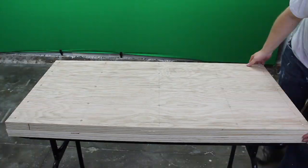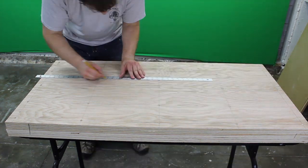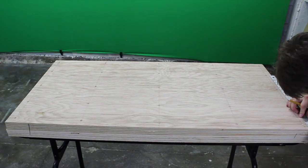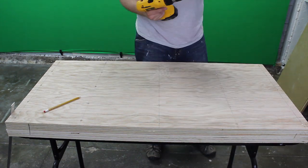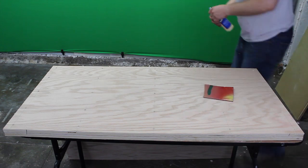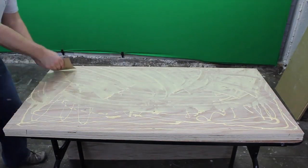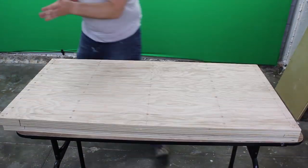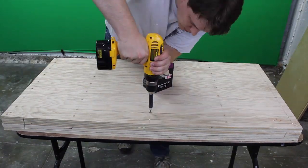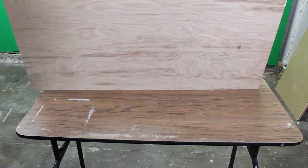Now we need to start laying out for both pieces to come together — in this case we have both laminates. Line them up using one of the corners as a true, and because we already had the grid lines from the first lamination, all we're doing is splitting the difference and making lines down the middle so we don't hit any of the other screws. Make sure to get your countersink and start drilling it every single time, because we're pulling off this top to put the glue down again. This is a ton of glue, but it's well worth it to ensure a perfectly good bond — we're basically trying to create a big three-inch slab of wood. Start from the middle and work your way out. These are two and a half inch screws so they hit every piece of wood, all countersunk for a nice flat surface.